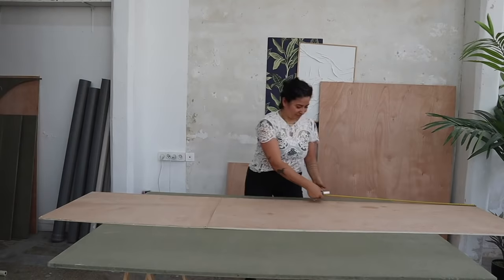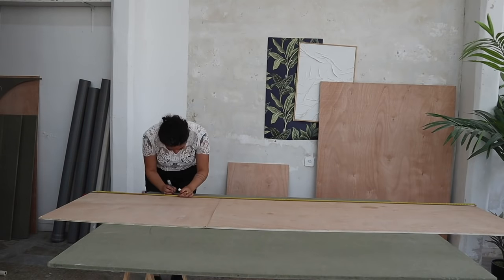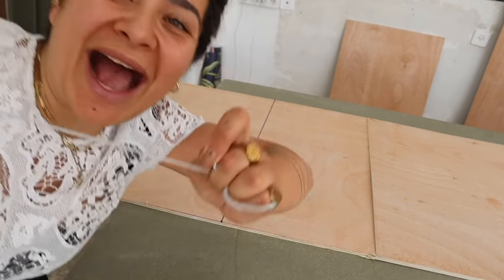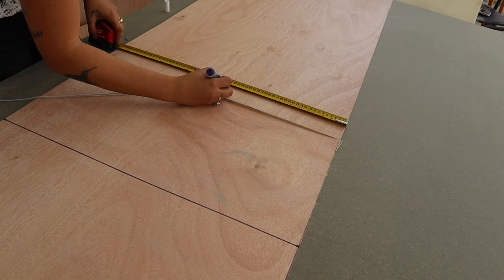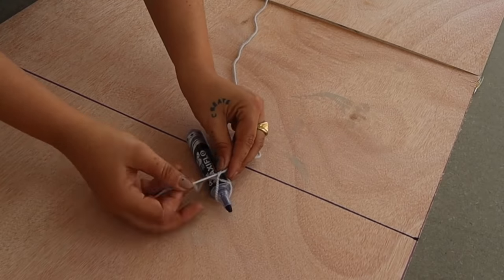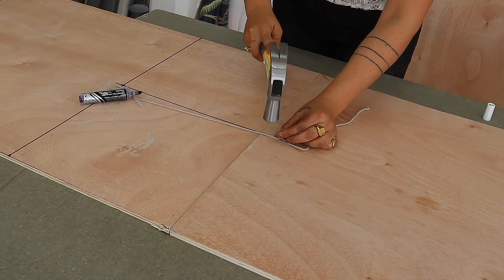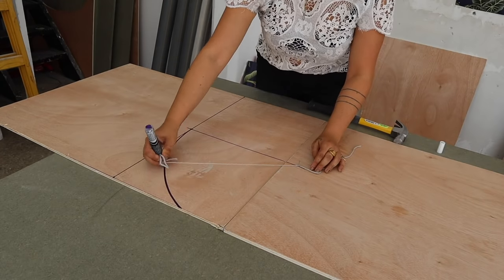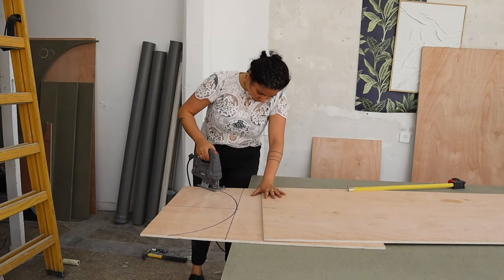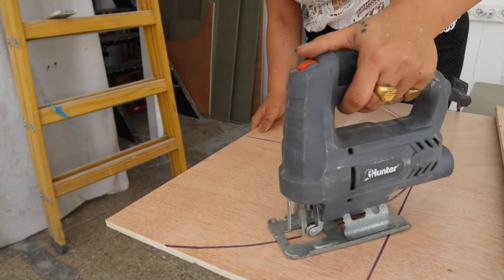Let's go and mark the sides of the couch and then we're going to make the round edges. Now we're simply going to add on the top part where we want our couch to start to curve. Here's the easiest and smartest hack there is: to make a circle you simply find the middle of your board, tie a marker to a rope and then you use it as a compass. So simple. Then you can take out your jigsaw and your half circle is going to be perfect.